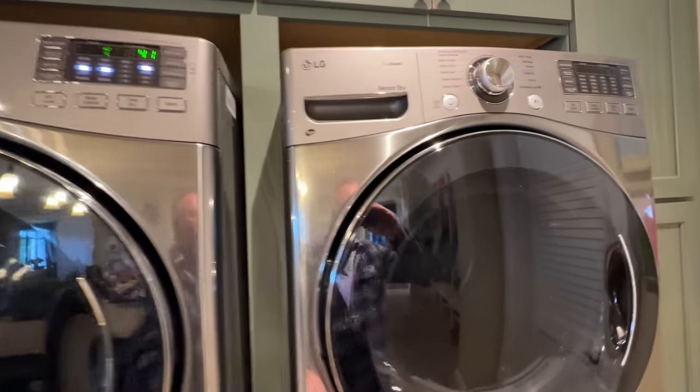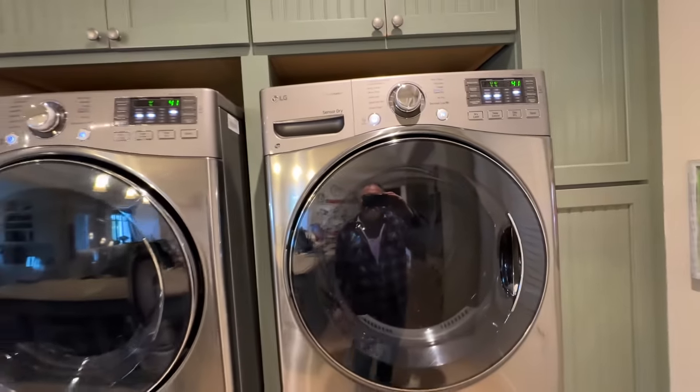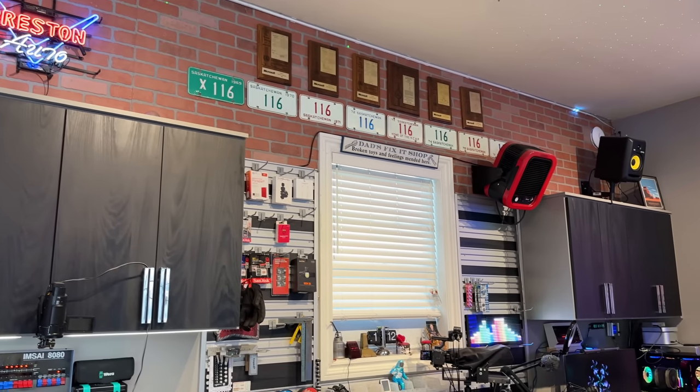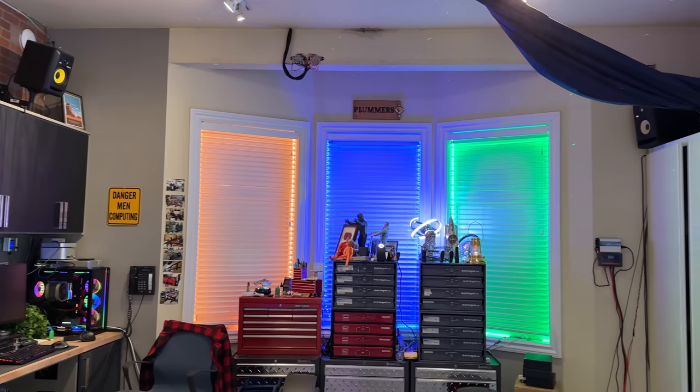At this point I was pulling close to 4,000 watts total, so the smart thing to do when you've got double dryers is to try them both. I fired up a second dryer, briefly pulling almost 7,000 watts combined, and it all still worked properly. The shop in Dave's Garage is powered off a subpanel connected to the house panel we're working with, so once I turned the dryers off, I should be able to power the entire shop circuit simply by turning on the breaker to the subpanel. Sure enough, the shop powers right up, and in a minute or so the Wi-Fi LED lighting is also working, since the server rack is also being powered by the Delta Pros and the Wi-Fi access points are all PoE. Much success.